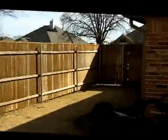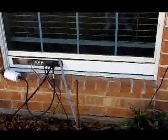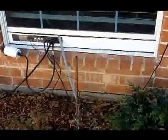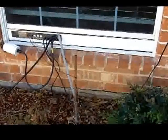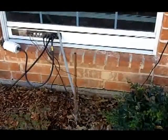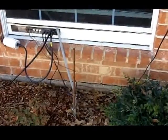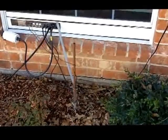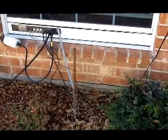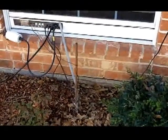Anyway, that's my grounding out here in the backyard. The main ground is very, very near the radios, which are right through that window, and the braid is very short and straight — basically directly from the antenna tuner straight into the ground rod. All the other equipment is grounded into this piece of braid at a single point inside the shack, so all the equipment comes into this ground and directly to the ground wire.